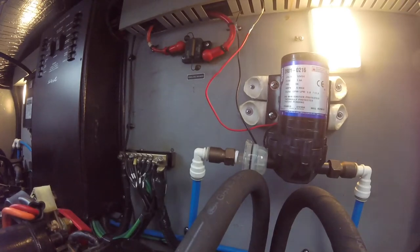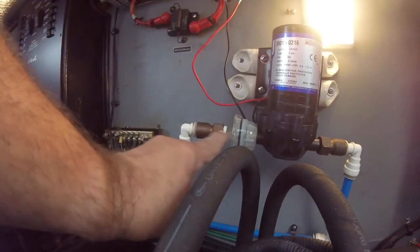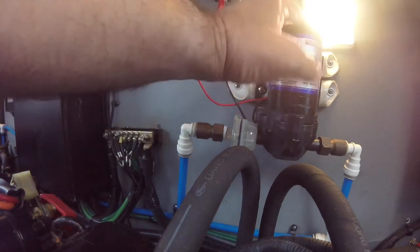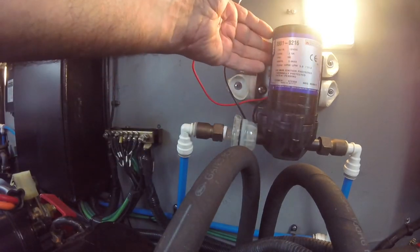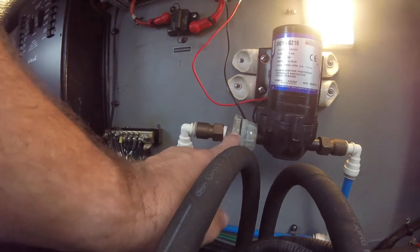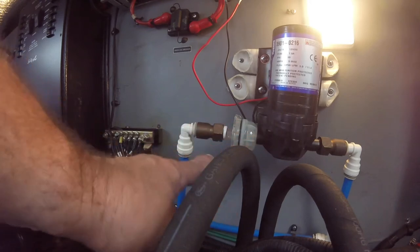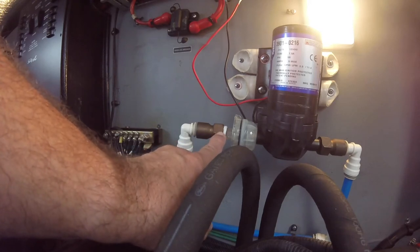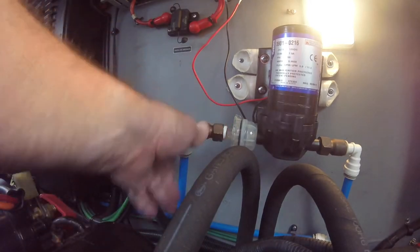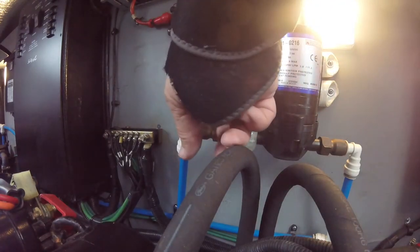Right now I'm having water pressure issues. My first problem I see is it's not leaking, it didn't freeze up, it's running — but sometimes it runs and doesn't shut down. I'm not sure what this is, it's either a strainer, a little filter, or a check valve, but I'm going to open that up and clean it out. Right here I can see this is cross-threaded, and if it's cross-threaded there's a good possibility it might be sucking in a little bit of air as it's pumping. This is the supply side, and this goes out to the faucets in the boat.